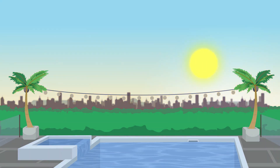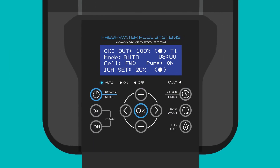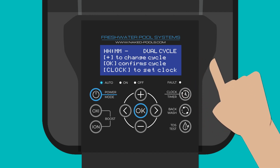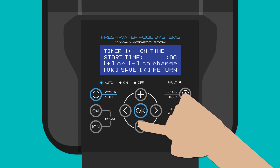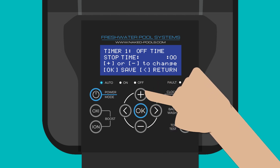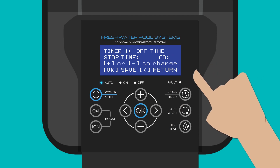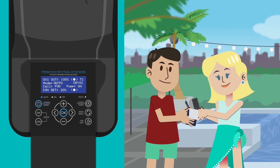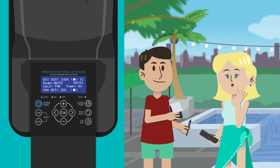Once completed, you can now set up the control unit to the external controller. Option one is the typical setup for most pools with automation. On your control unit, you will need to change from a dual cycle to a single cycle timer and change all timers to zero zero. If all the timers are not set to zero zero, the unit will switch from on back to auto when the next timer is set to start. You may want to take note of what the default run times are set to in the Naked system.